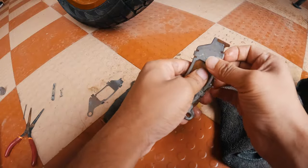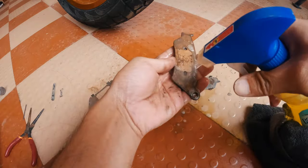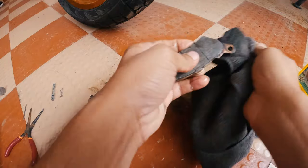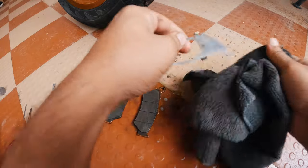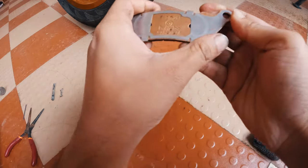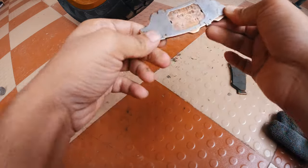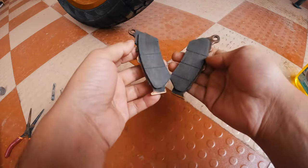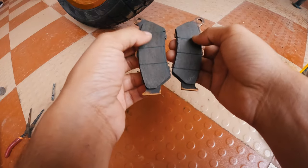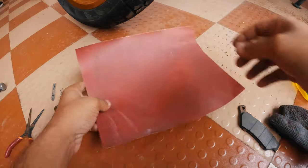Now comes the second pad. Reinstall the plates and align the holes. The disc pads are now clean. Next, I'll remove the upper hard layer from the disc pads using sandpaper — here I'm using a 220 grit sandpaper. Lay it down flat.